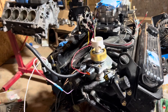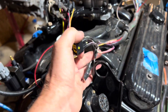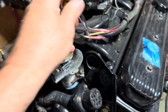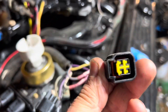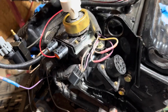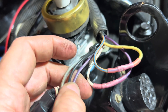Let me explain what I've done. With a Thunderbolt 5, the module used to be over here on this side — right here on the exhaust riser — and there were two connectors: this one and this connector here. The first thing I do is I cut this wire, cut it off. There's a purple wire and a tan with blue stripe. That left me with a tan wire with a blue stripe and a purple wire.